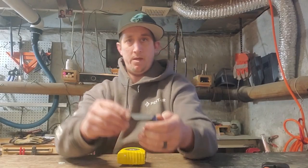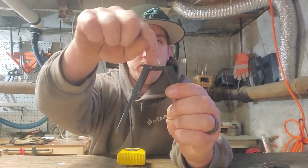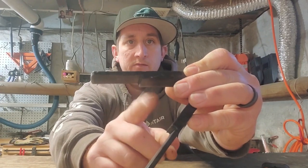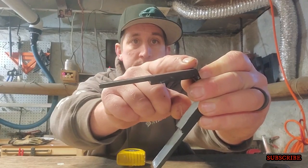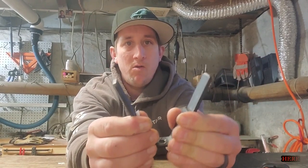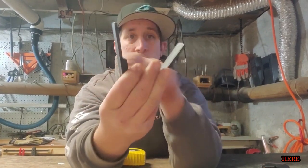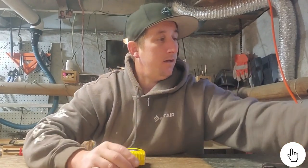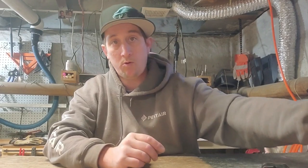So I have the brackets all built. I took the one-inch piece and welded it to the two two-inch pieces at a 75-degree offset, then welded the three-inch piece to the top. That's going to stiffen everything up, make it a lot stronger, and give me a nice long standoff. Now I have both standoffs built, and the next thing I'm going to work on is the step itself.